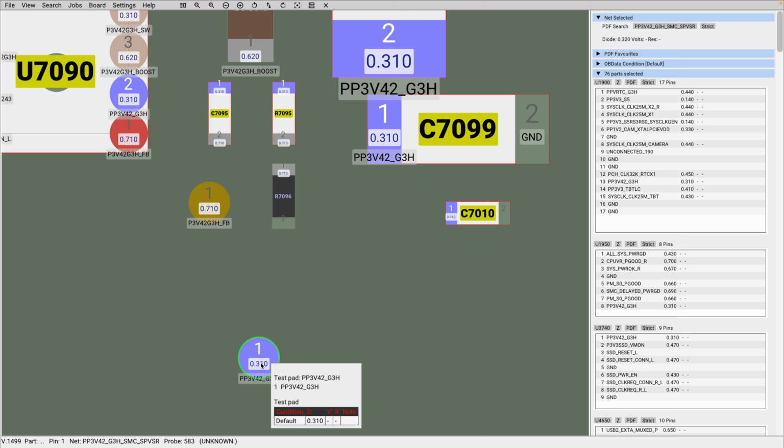So the best way is to finish one before you move on to the next. By that I mean, when you place your probe on your test point or whatever component you're using, make sure you place it firmly so that it doesn't move. You see what you're doing, and after that is done, now you can move your face to your multimeter to see what you are measuring. Give it a bit of time, be sure the voltage is not fluctuating, and then you can move on.